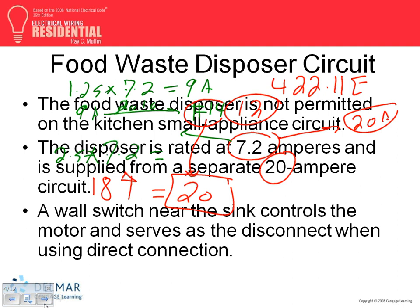Yes. Has this been a motor somewhere else? I can put 20 amps on number 14. Residential, no. 20 amps, because you guys are wiring a receptacle. The receptacle, yes, it's for the garbage disposal, but you can argue anybody can plug anything into it, right? It's a receptacle. It's not hardwired. Okay, any questions, guys, about that? So that's why we came up with 20 amps, number 12. Everybody did 20 amp number 12 for the garbage disposal?